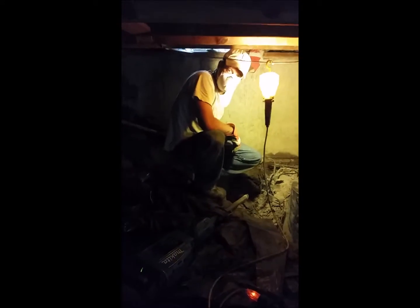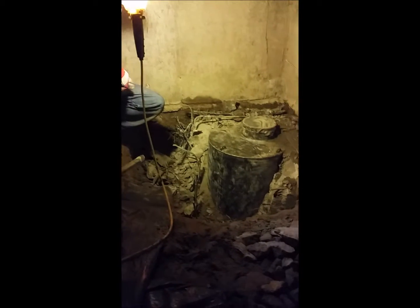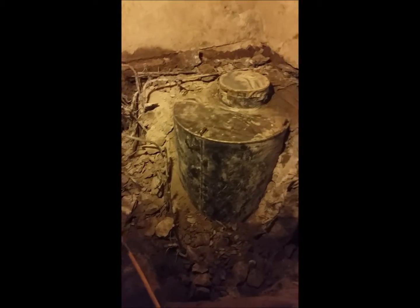We're walking through into the next day now. We've got about half of this cement jackhammered out around the unknown — looks like it's almost a three-foot-long container. We've reached the bottom over here. There's a lot of rebar in the way and it just isn't breaking up well. We increased our jackhammer to the biggest one possible, but it's still kicking our butt. There's rebar about every four inches each way, with wire mesh — it's ridiculously hard to even jar up the concrete.